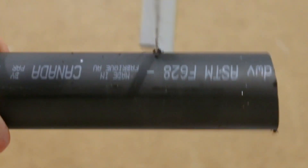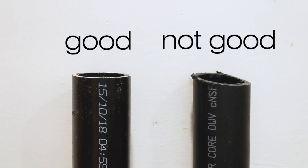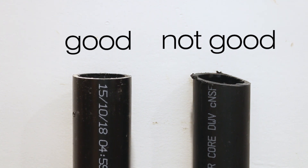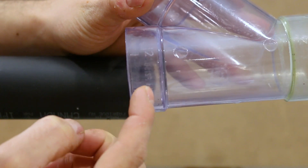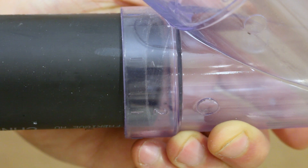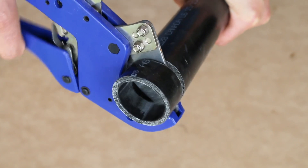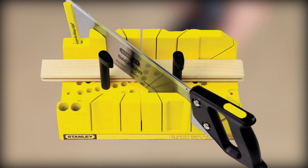Number two is installing a pipe that was cut crooked. As a beginner, we tend to want to do things quick and sacrifice quality for speed. But the hub portion of the fitting doesn't have a big margin for errors — if a pipe has a quarter inch missing on it, it could mean the difference between having no leak and having one. To avoid this, I don't recommend using a saw but rather use some ratchet cutters like these. Another good alternative for beginners would be to use a small miter box and an appropriate saw. This will ensure your cuts are perfectly straight and you won't risk having a leak.